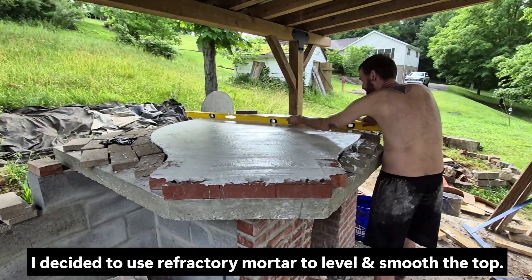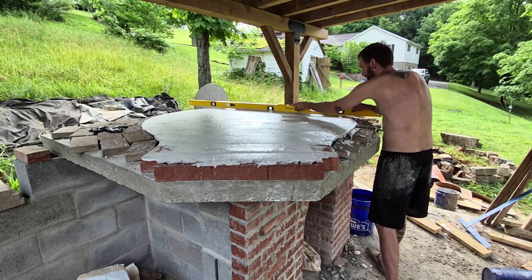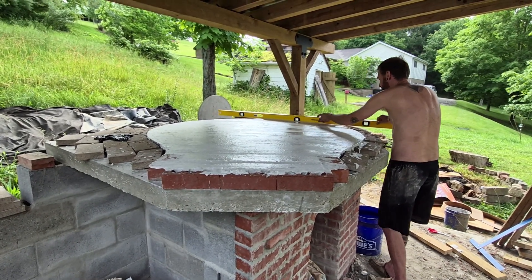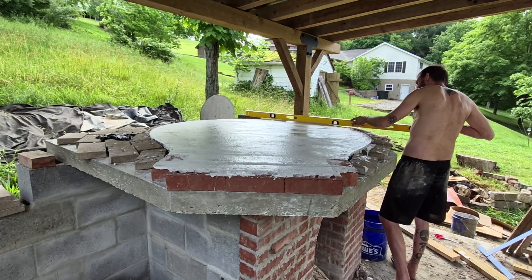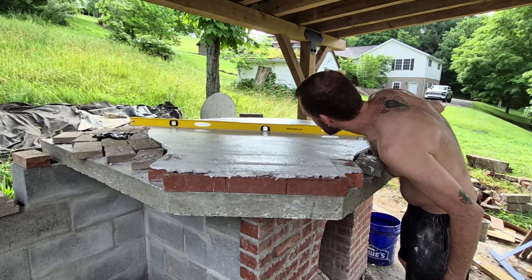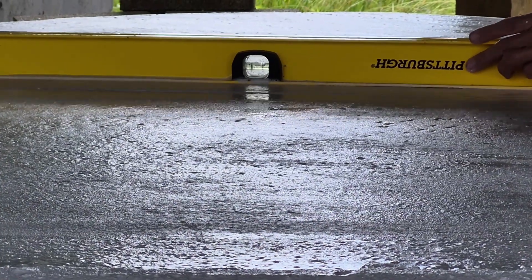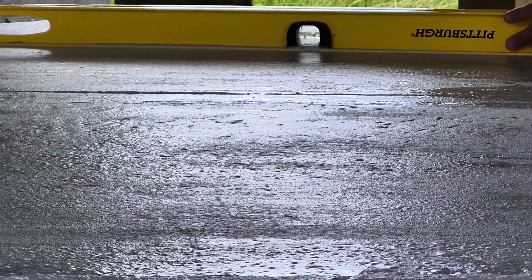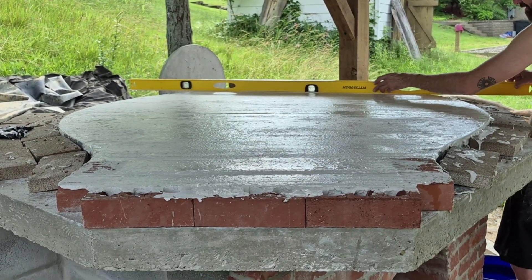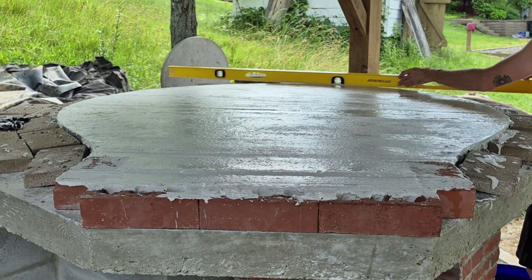Okay, I've screeded this. Now I'm just smoothing it out. This is actually a refractory mortar that I made a top coat with, just to level out the insulated concrete. So this, when it's all said and done — I don't know if you can see that — that is spot on level. I shouldn't need much of the regular sand with this. The refractory mortar is pretty much the right type of sand with the right type of chemicals in it, so I figured it couldn't hurt. Even regular sand would work if you want to do it that way — I just figured getting a nice concrete-style layer would be better.